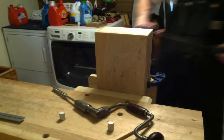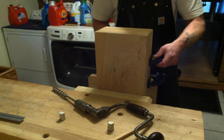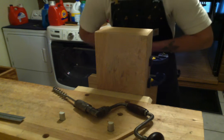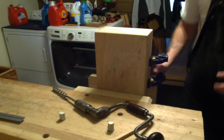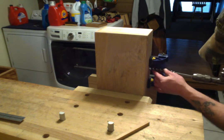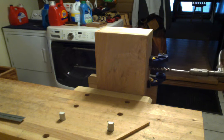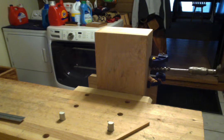I'm just clamping a block on the back, and now I can drill through without any breakout. My problem was I lost my snail when I broke through the other side on previous ones, so this should help. I'll go a little bit further and should be into the other piece right now.